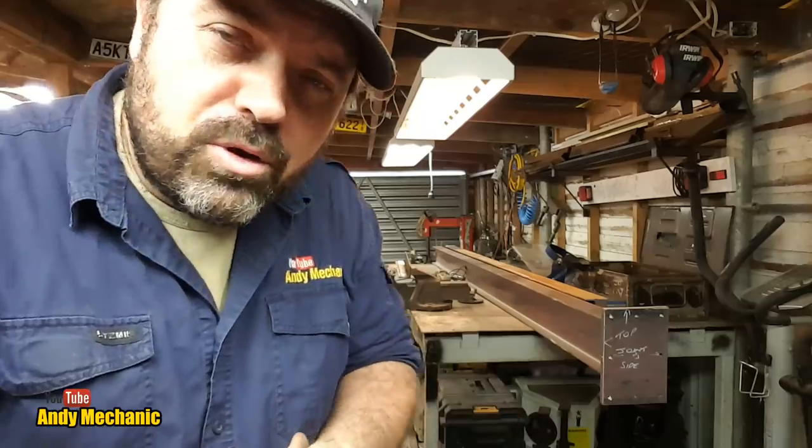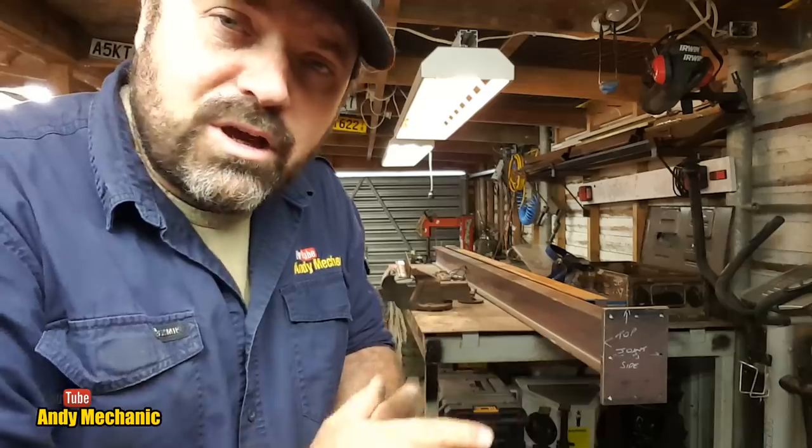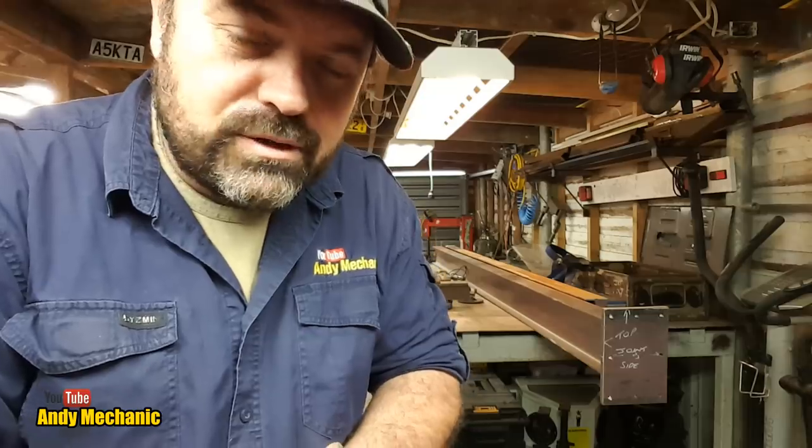Those posts are original — put up for the lean-to garage. There are four of those that run down, and I'm going to be mounting off those, running across the roof to the side of the garage. There'll be some steelwork coming off the concrete wall on the other side, and then these four beams will go into place. Hopefully they'll hold the roof up and I can take that retaining wall out — it may all come crashing down, who knows.